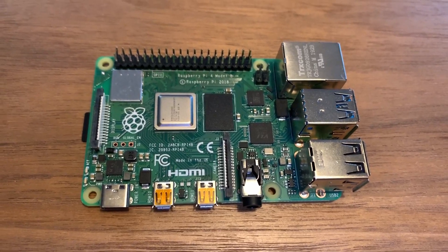So with those requirements in mind, let's go over the components I actually selected. Single board computer — it was in the title of the video, so it will be no surprise that I chose the Pi 4. I looked at other things like using an Intel Compute Stick or the Chuwi LarkBox. I also looked at doing an Nvidia Shield TV. In the end, I went with the Pi 4 because nothing can compete in terms of community support, which is going to be a huge deal for finding drivers and modules for everything. The one downside of the Pi 4 is heat.